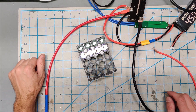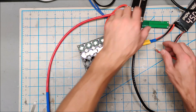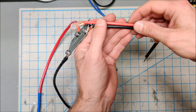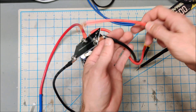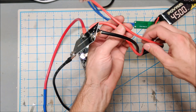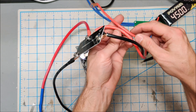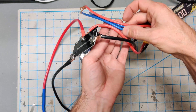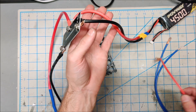I've been doing some playing with the PCB spot welder and I've decided to make a few upgrades. I noticed these are the leads coming from the battery, and this is the spot welding needle. It's actually thinner gauge wire on the needle than coming from the battery. That thinner gauge wire was reducing the effectiveness of the spot welding needles. It's 10 gauge coming from the battery but 12 gauge on the needles.